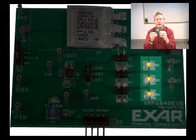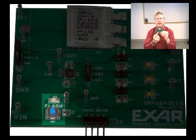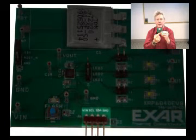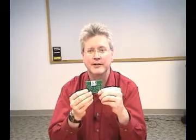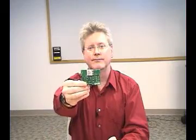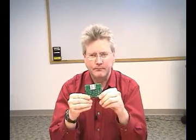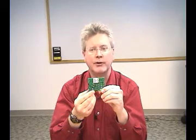On the right, we can see three LEDs, which are Rebel PWF4 flash. There's also a flash push button and a flash ready indicator, as well as the I2C interface. This board is programmed to output a total of 4.3 amps, its maximum, over 400 lux. You may want to put on your sunglasses for this one. As you can see, that was pretty bright. Also, the flash indicator is already on, meaning the board's ready for another flash.